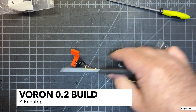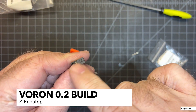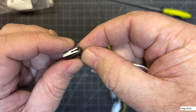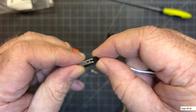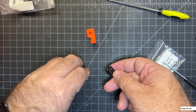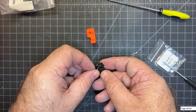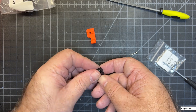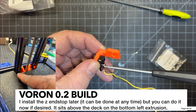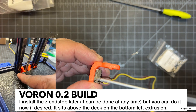What you want to do is remove the metal piece — sometimes there's a little piece here. You can see here's one that doesn't have it, so just pinch it in to pull it out. You want it just like this, then use your M2 by 10 threaded screws and go ahead and put those in here. Get one started and sink it right into the plastic. Make sure your switch is towards the outside edge.